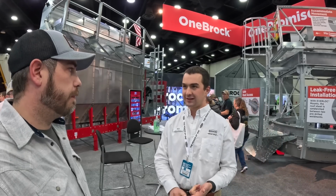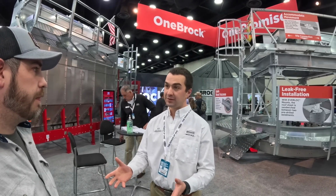A couple things to think about. Mixed flow dryers have no screens to clean. That's something a lot of people get excited about, is screen cleaning. In a screen dryer, when the screens get plugged, it loses efficiency and loses capacity. I like to say it's like running a race wearing a mask. None of us want to remember that. So that's what can happen with a screen dryer.